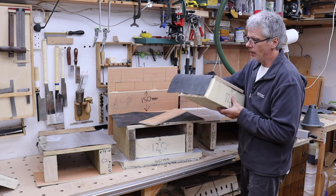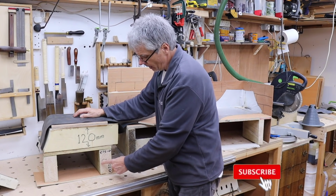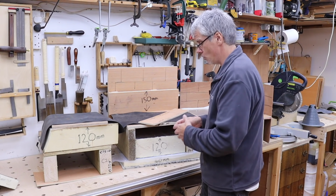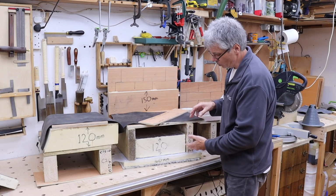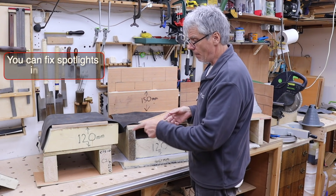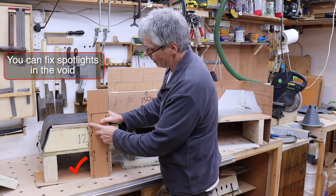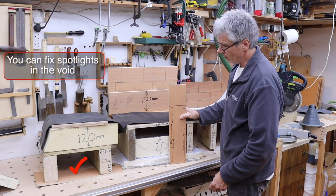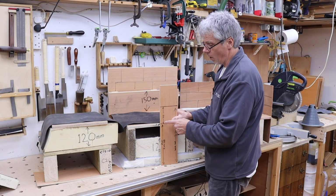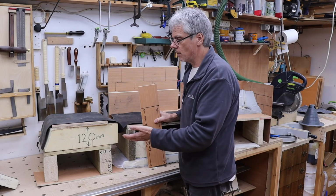If I take this over here, recently we did a job with 6 by 3 timbers, and they are C24, so they're a much stronger timber. And you have to get this designed. You can't just swap from your 200 by 50 or 8 by 2 timbers to this. You must talk to your engineers and get it designed. But this is 50mm shorter. And if we start looking at the height of that, the difference is 60mm compared with this. So you're only 60mm higher on this one than you are on a true cold roof, and yet it's much more of a robust build.